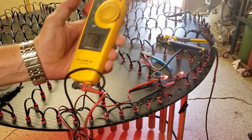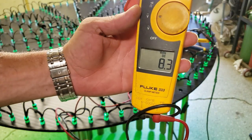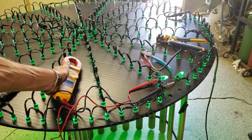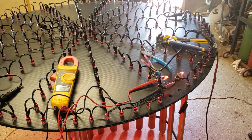And even more surprisingly, if you can see here, when it goes to white you'll notice it's dropping down to 5.9 volts. I'm honestly surprised that these pixels are even working — they're not flickering, they're not doing anything. So most people would say it's perfectly fine, leave it alone and just put it out in the display, which is conventional wisdom.